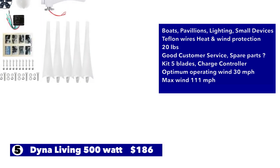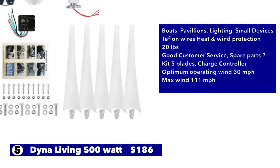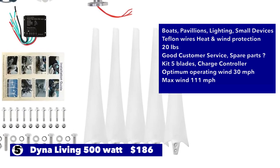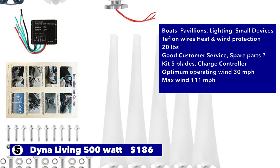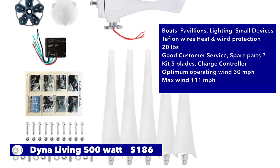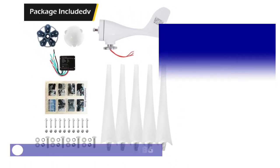Kit includes a wind turbine generator, 5 rotor blades, the charge controller, user manual, and mounting accessories. You would need a flagpole to mount the unit on. It's fairly easy to mount. Wind speeds required are a minimum of 5 miles an hour, so you need to be in an area of average wind. It's rated to perform at full power at about 30 miles per hour, and the max wind speed it can tolerate is 111 miles per hour.